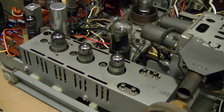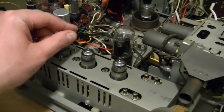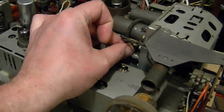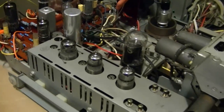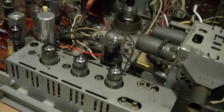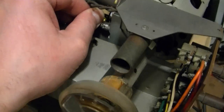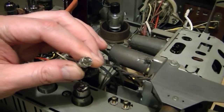I did check the tubes, though. That's about it. So I tried the obvious things — wiggled the tubes, wiggled the cables, no change. So what I tried doing now was injecting some signals. It's actually kind of convenient the way they set this up, so this jack right here is the output of the tuner. You can feed the IF right into this.